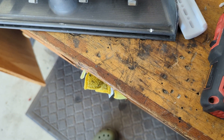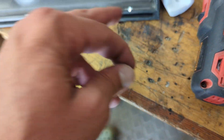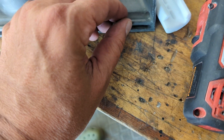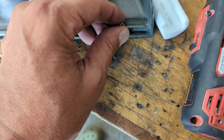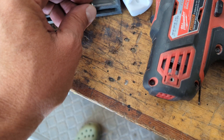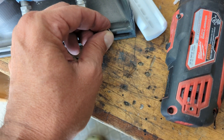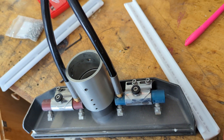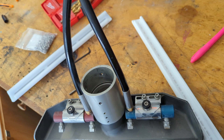There you go — that took about 10 swipes of a round file to create that little set screw divot, valley, hole — whatever you want to call it. It's going to fall right into there. What you don't want to do is over-tighten it, because all you're going to do is strip out the Teflon threads. So let me install the glide and show you what I mean.